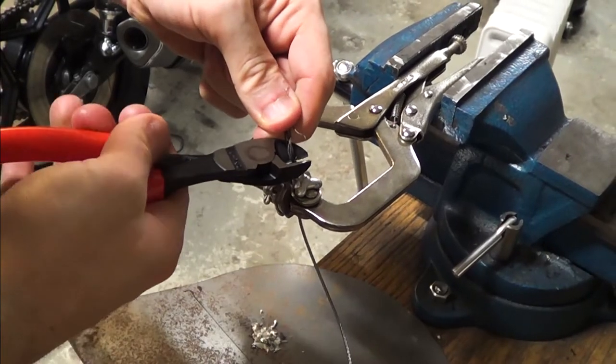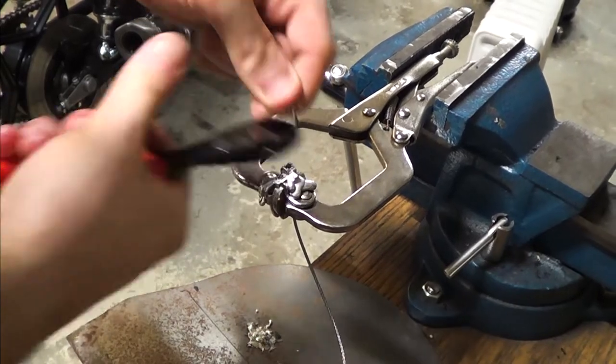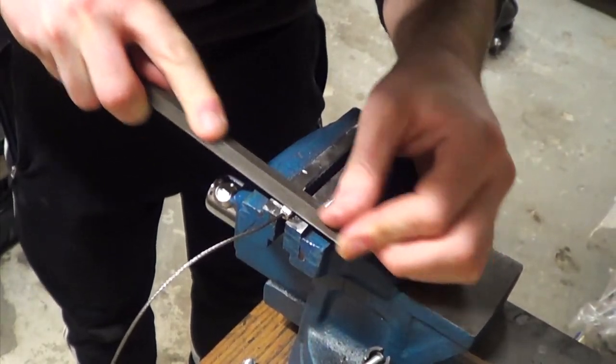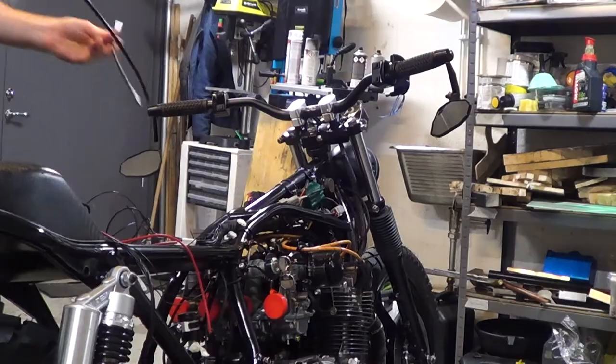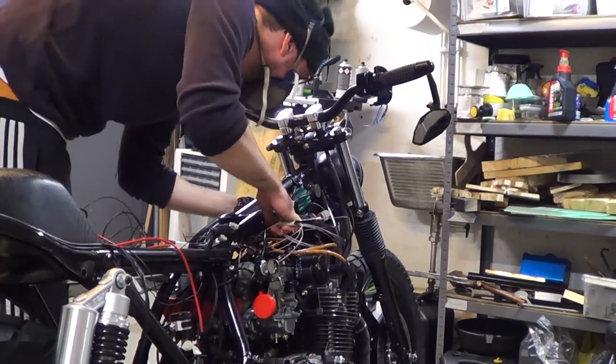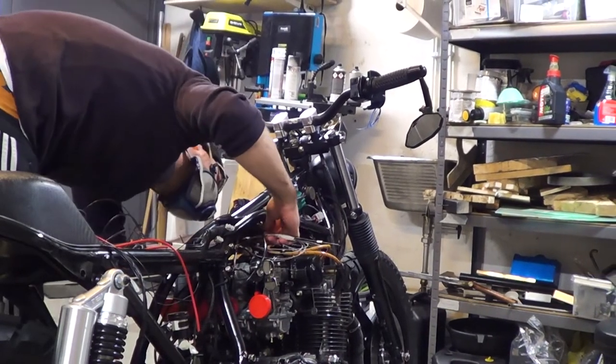When I was happy, I started to clean up. I cut away the wire strands, I amputated the terminal from my vice grips, and I started to file away the excess solder. Then I took the cable back to the bike — and I was using a face mask when soldering. Particularly the flux could be pretty nasty.